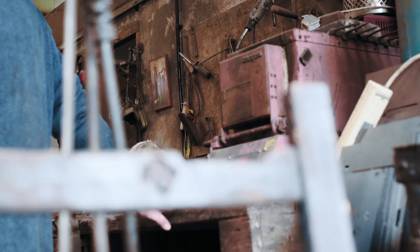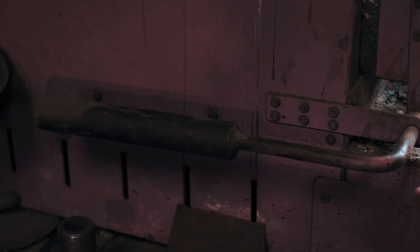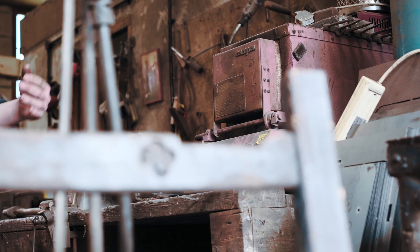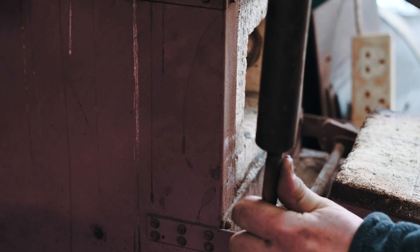The oven has cooled back down now and I've set it up to 200 degrees centigrade. I'm just going to put this in — that goes in there for two cycles of three hours. I'll do the first one at 200°C to actually set the hardness of the temper, and then the second cycle at 180°C, because it's not about reducing the hardness anymore — it's more about helping some of the austenite, which is the soft phase of the steel, to convert into martensite. When you temper a knife, even though it comes out softer than you put it in, you end up with more martensite. It's softer, but it's almost a higher quality of hardness in a way. So we'll leave that for about three hours — I'll probably get back with you tomorrow.